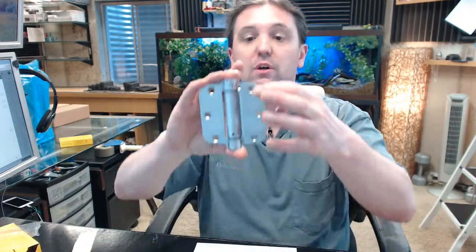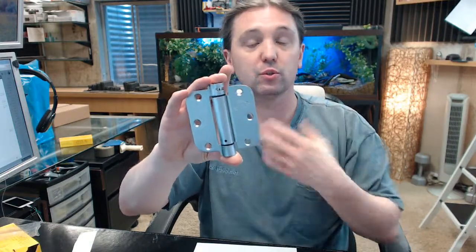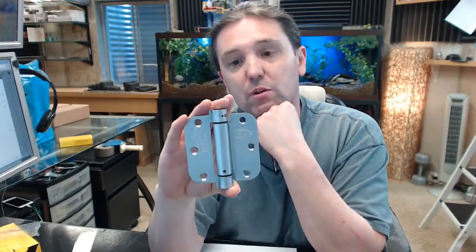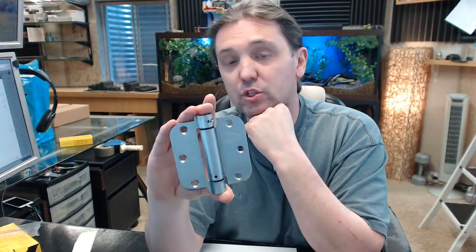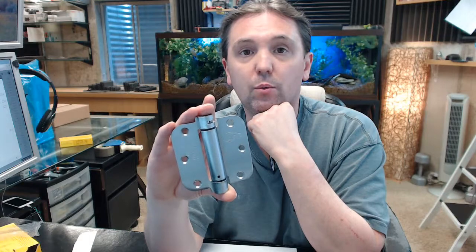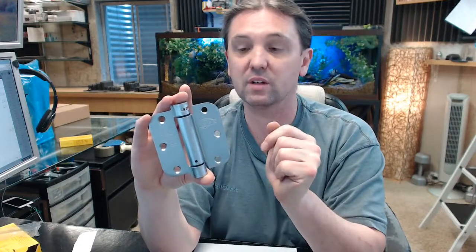There is a link below this video to a document called Template, and that is a handy document because it allows you to review all of the dimensional properties of the hinge, namely the location of the screws, which is what we would term template. That's the standard pattern. If it's a 3.5 inch hinge, it's probably an 1 3/8 door. So keep that in mind. I've seen 3.5 inch hinges on 1 3/4 doors as well, but that's very uncommon.